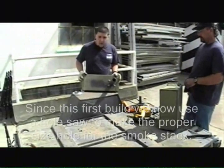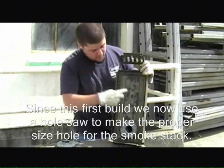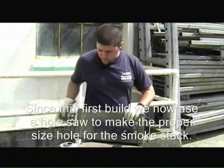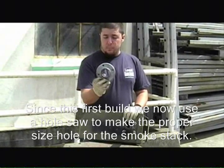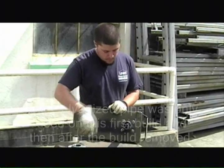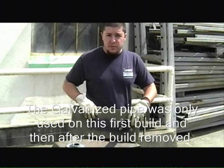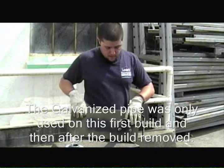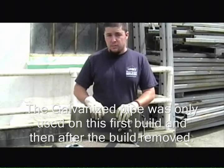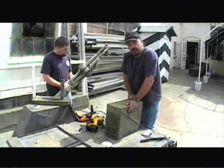Josh, you want to tell them what you did to the top? I took a drill press with a hole saw bit and punched a hole right through the top. Take your time with this because there are ribs that are double-layered down the inside of the lid, so it does take a little bit of time — maybe use some cutting oil. I found this one-and-a-half inch plumbing flange, and these four holes allowed me to attach it through the bottom, punch a couple of extra holes on the top, and it basically sealed up our opening. Then I put a piece of about 10-inch, one-and-a-half inch galvanized piping for our stovepipe for the time being. You can flare that out, run something bigger, put a coupler on it, piece it together to make it longer, or just clamp on some exhaust pipe for medium ventilation. Now we're going to attach these feet and then we'll pretty much be done.